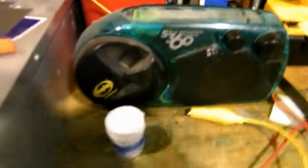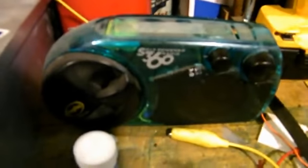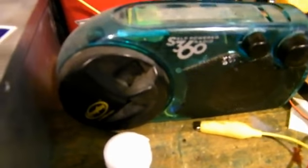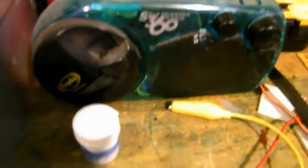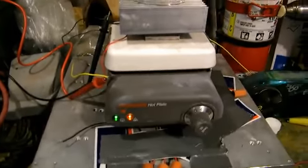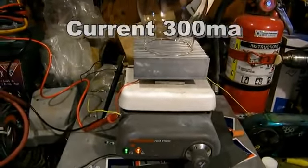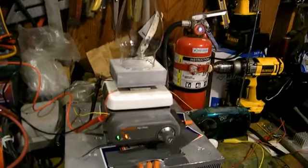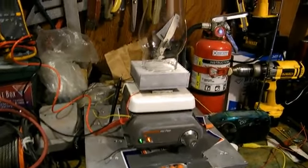And here is my little wind-up radio. I have this wired directly from the TEC to the probes right to the radio, and that's going into the winder generator part. I figured due to varying voltages in the test, this will be the most reliable as it's not burning out the radio and the circuitry. But this little operation, just with that TEC, this little heater, and a passive cooling, giving us a 3 volt and slowly declining voltage, I figured, well, hey, you can use that on a stove or anything that has a temperature differential, and especially in the wintertime up here in North Dakota, you can have a very large temperature differential from the minus whatever it is outside to as hot as we want to keep it on the inside here.